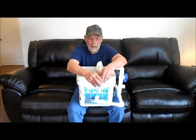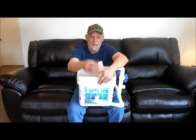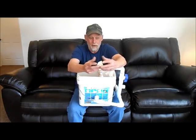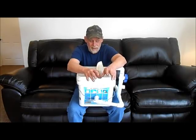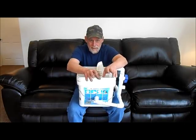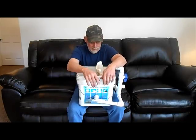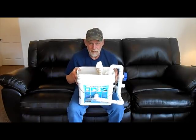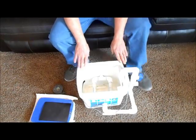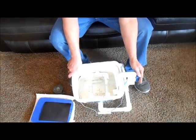When I show it to you, kind of think of it like a gold rush nugget bucket where the water comes down into the little tub and boils out all the light stuff, and all the heavy stuff stays in the bottom. That's what I'm attempting to do with this. Let me tear this apart and show you what I've got, then we can take it outside and see if we can catch some gold. We'll start with the bucket — I've got water flow coming in here, a valve, water coming in the top going down to the bottom.